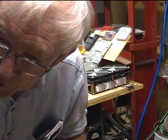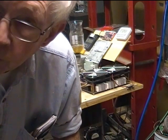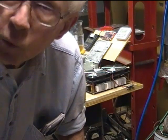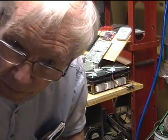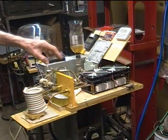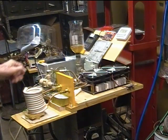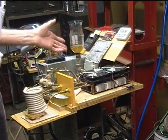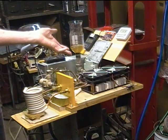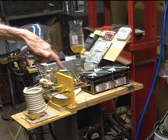Today's test is to answer the question: can I turn on the power to my ZVS induction heater while there's already work in the work coil? Power supply is on, water cooling and all that stuff is on, fans are on, and we are drawing an idle current of 6 amperes today and we have 37.8 kilohertz for the idle current frequency.